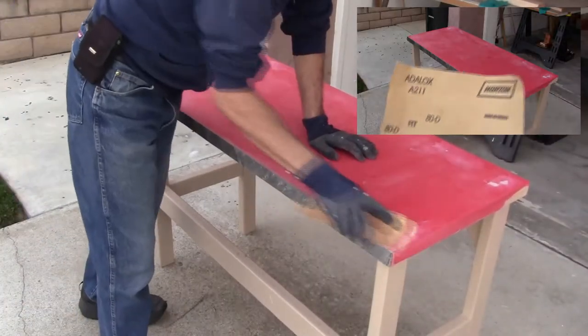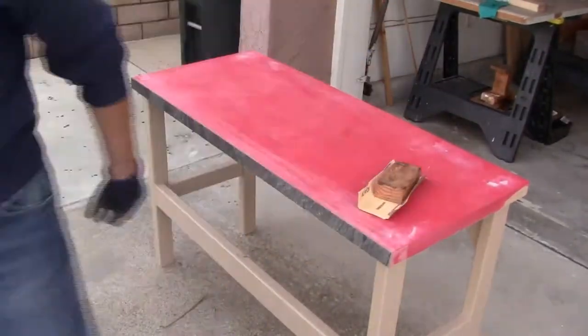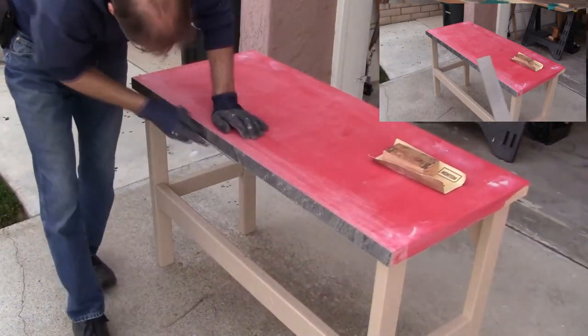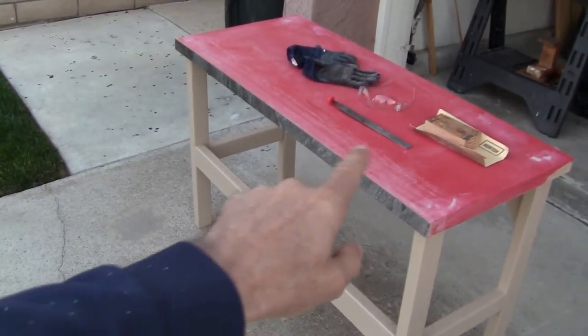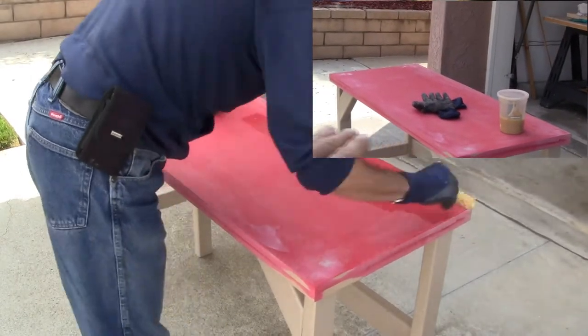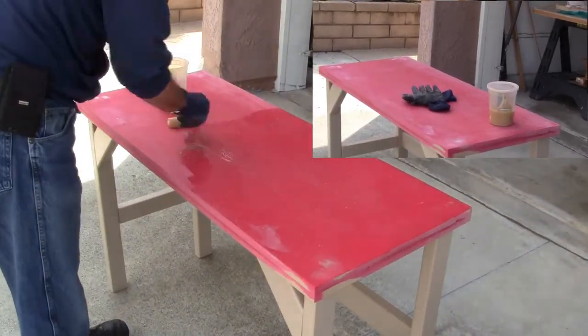Now I'm going to take some 80 grit sandpaper with just a 2x4. Now I'm going to take a file and if there's any burr left from the routing, I'm just going to hit the edges around the perimeter to make sure everything is nice and smooth. This piece is completely set and ready to go — I've got it all filed down. A nice detail of how that turns out — it comes out pretty good. Everything is perfectly flat and well bonded to the table. I've got the tabletop completely prepped for the contact cement — it's all wiped down, sanded, and good to go, ready to apply contact cement.